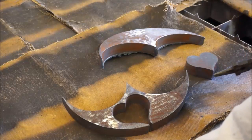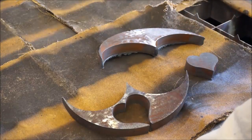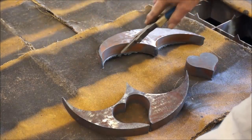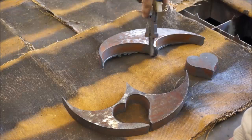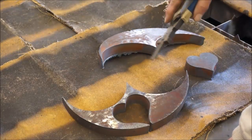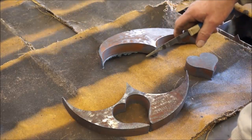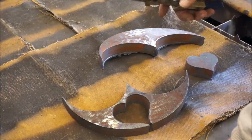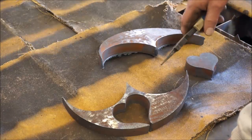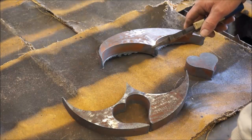It's reaching pretty close to the max on my cut, and if I was to say a tolerance that I could hold on big large cutting areas, like this ring right here, these circles that I cut out of this piece, this was a pretty true cut. In fact, I three jawed them, bored out the inside, did a face cut, and I left the outside exactly the plasma cut, because it was that good of a cut.